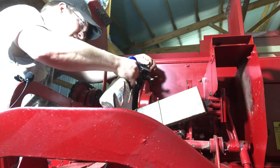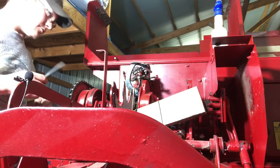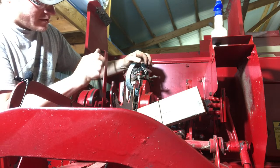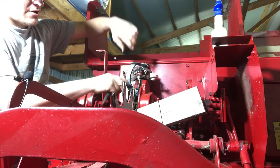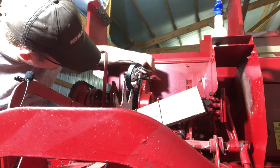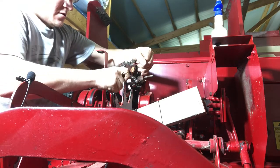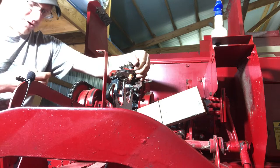Let's put some penetrating oil on here. So the first thing I'm going to try is I'm going to put this chisel and drive it between this end of the frame and the bill hook pinion. What that's going to do is push that bill hook pinion down, which is the direction we need it to go because we're going to pull the bill hook out and this pinion is going to fall right out of there. I did move it — I moved it a long ways actually, so that's good. Now I'm going to have to watch it because as you move that bill hook it's going to change the way your knife arm slides on it. You don't want to be in a spot where you can't get back — you don't want to get to a place where you can't get back home.